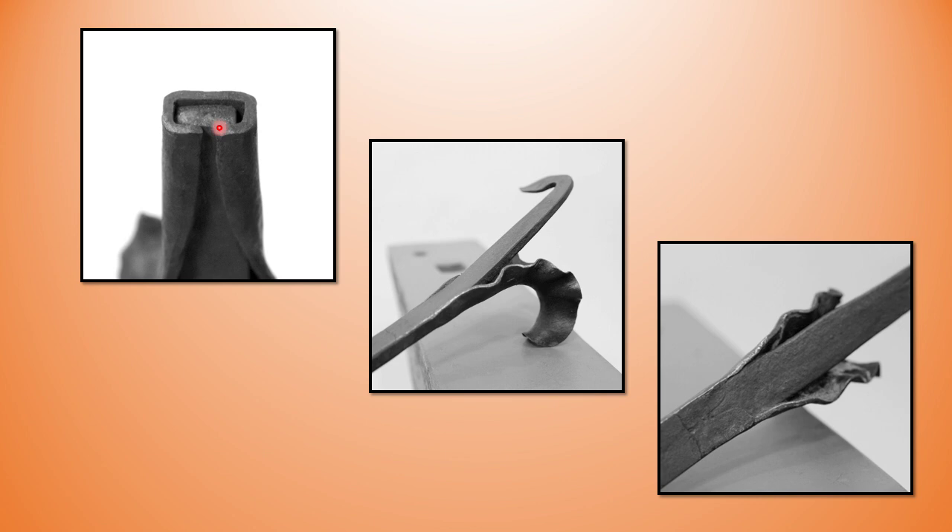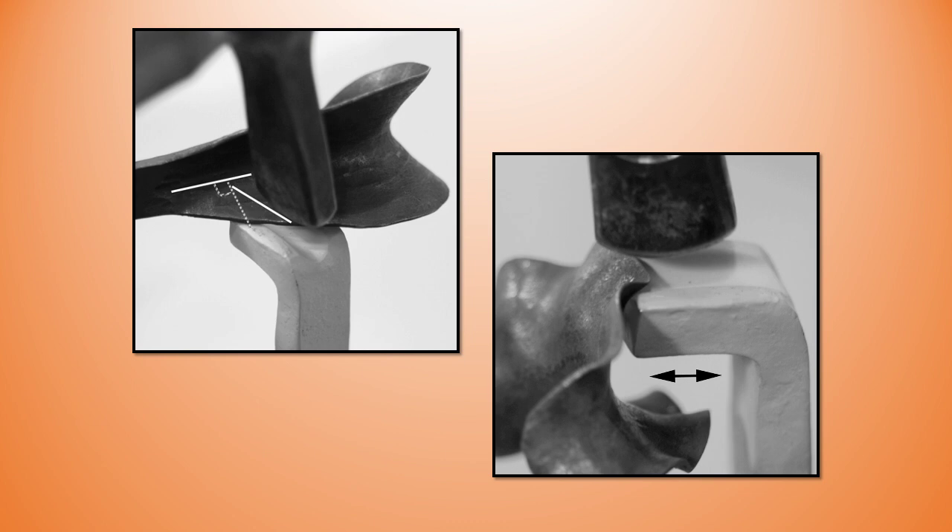It's one more bar of steel to buy: for the three-quarter inch by quarter-inch starting stock, you're going to need two-inch by one-eighth inch flat bar to make the applique leaf — that's the perimeter of the parent bar with no allowance for welding. At this stage you're ready to crimp the edges of the leaf.